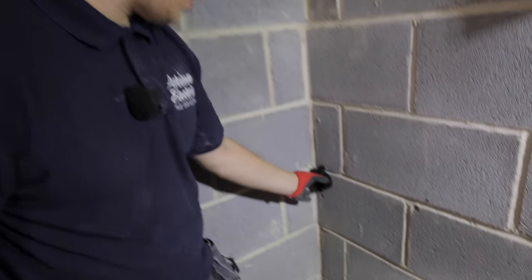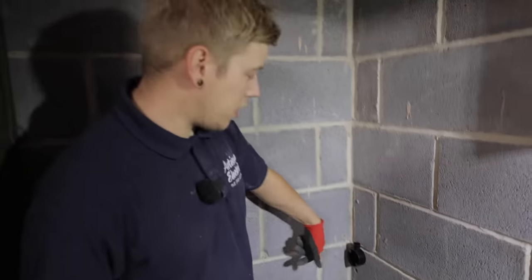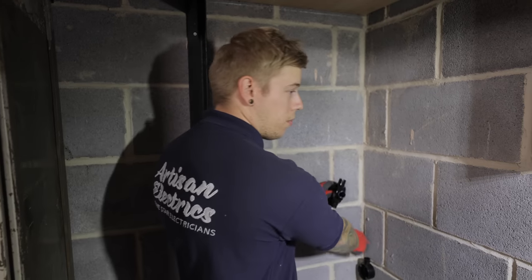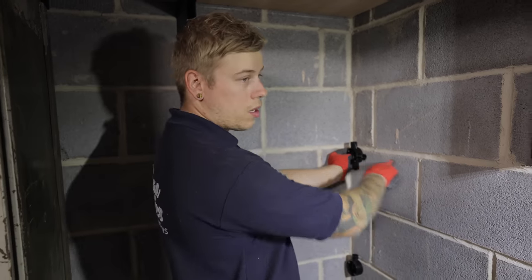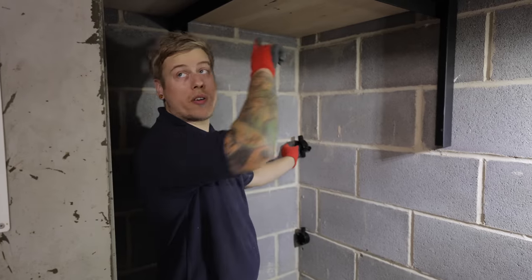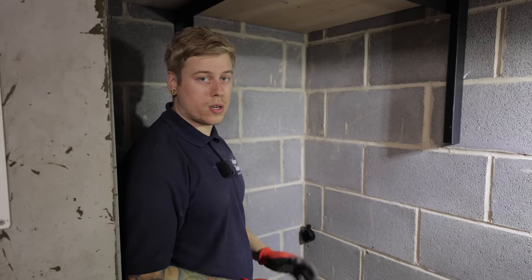Now I know that's flush to the wall, the conduit's protecting the cables where they go through the wall because I'm going to be using singles. From here we can put a T-piece, come along to two sockets on that little workbench, and then carry on up over this room and drill through outside ready to go to the greenhouse.